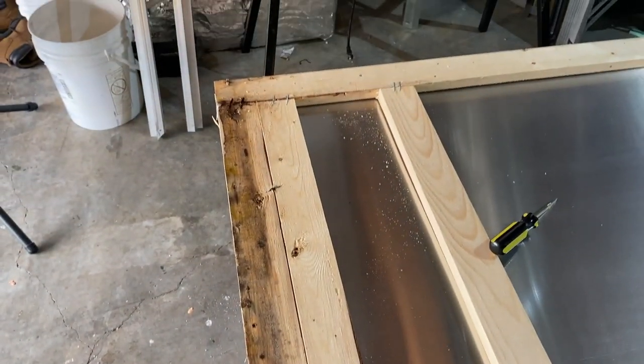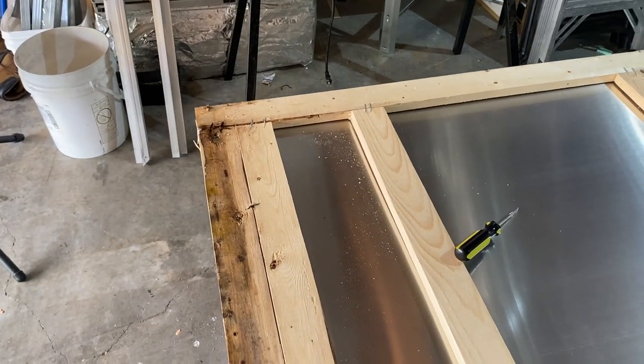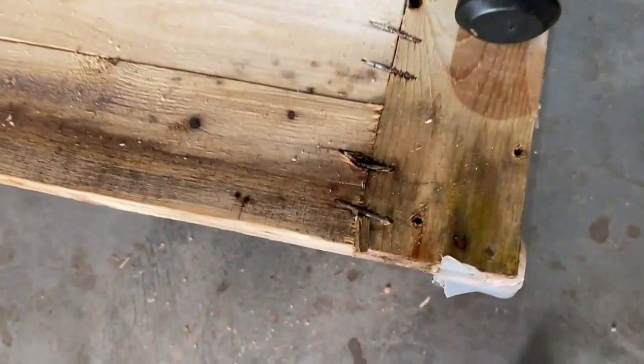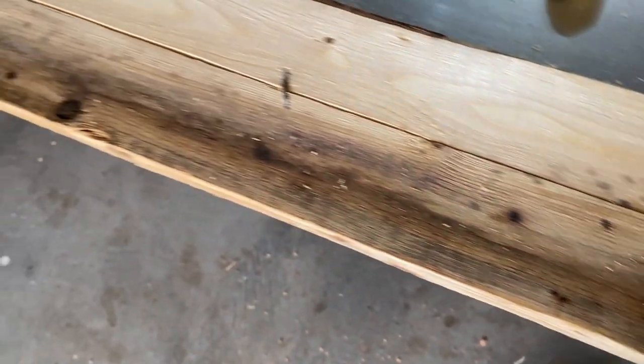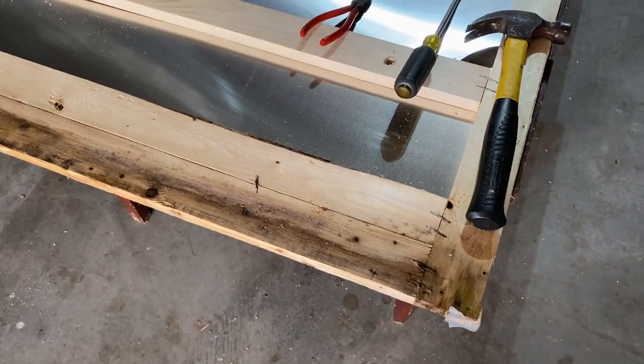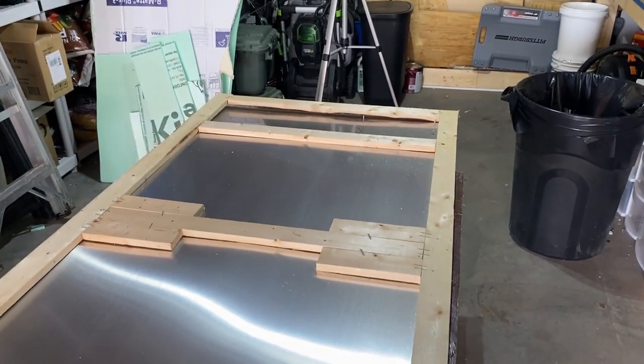You can see it looks pretty rotten and wet down here at the bottom of these doors — they're not really sealed very well. There are these weird long staples inside that I've had to ram a screwdriver under to pull out. I'm just going to replace the boards on the inside of the bottom and then reseal it so this doesn't happen again.